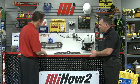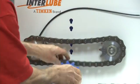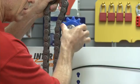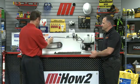Next, we need to determine where on the chain to mount the applicator. It can be mounted on the top, on the bottom, or sides of the chain when the chain is mounted vertically. Tom demonstrates by detaching the applicator from the top of the chain, unscrewing it, repositioning it on the bottom, tightening it to the bracket, and mounting the oil line back up. On a vertical chain application, you can go on either side or on the inside of the chain if room allows. Rotolube is completely customizable — for example, in an automotive plant with doors hanging on hooks before a paint room, you could mount the applicator on top so it stays out of the way of the attachments.